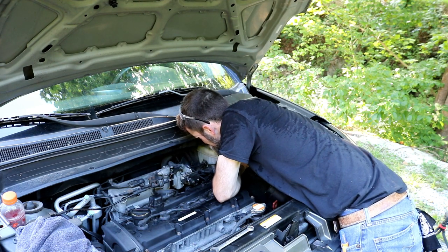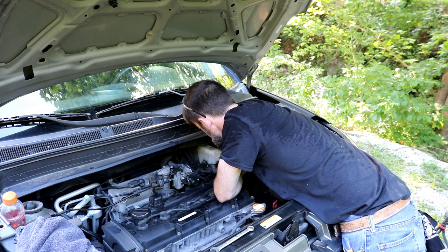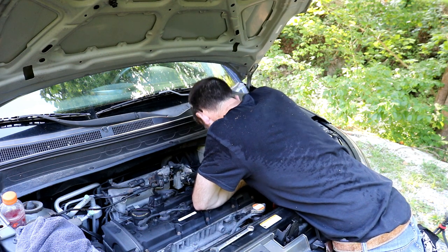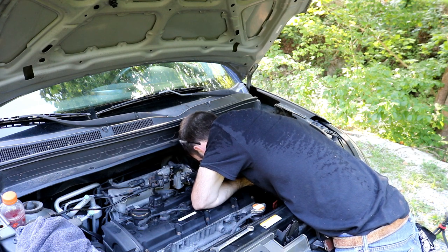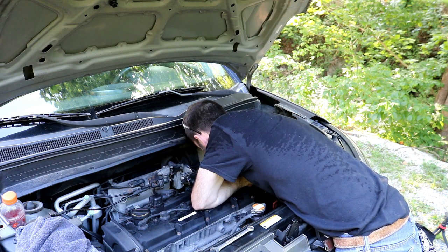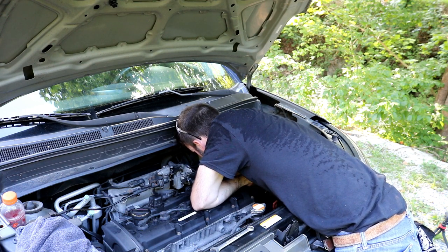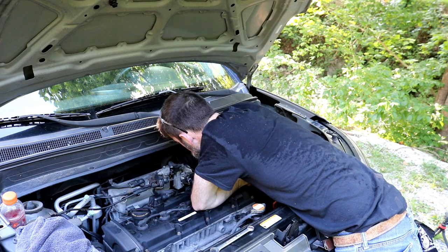So I was so glad that Elizabeth was willing to help me change the starter on this thing. I tried to reach the starter from the bottom of the car from crawling under it, but my arm was too big to even reach up and touch it in any useful manner anyway. And you could only get one arm, or at least I could, down from the top to work on it. So to reinstall the starter, she had to hold it in place from the bottom while I screwed bolts in from the top. Otherwise, you'd have had to remove the intake or the exhaust, maybe one of the CV axles, in order to just get two hands on the thing to get it installed.